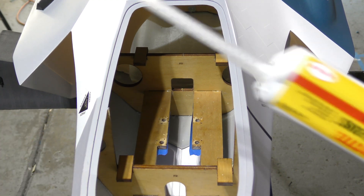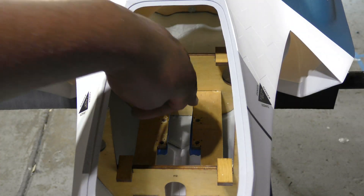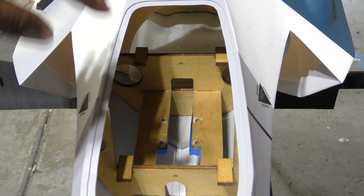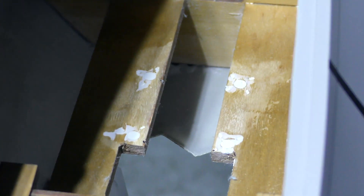I've put tape on the bottom side just so it catches the epoxy. I'm going to use E20NS epoxy to fill those holes — it'll form a nice hard bond to the wood, and then when we redrill for the new holes everything should be nice and tight. The epoxy is dry and I've sanded it down — it's very nice and smooth.